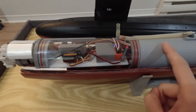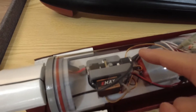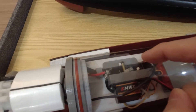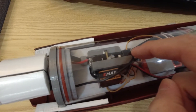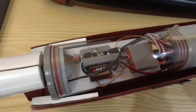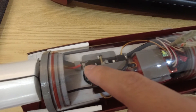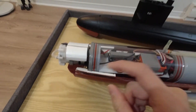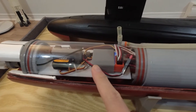Between the water pump and the ballast tank we have a servo-operated pinch valve — a very simple system. A micro servo operates a small brass roller attached to the servo arm. As the servo rotates clockwise and counterclockwise, the roller releases the black rubber hose, allowing water to flow freely in and out of the ballast tank. At the same time, the servo arm hits one of two micro switches that run the pump either forward or reverse to fill or empty the ballast tank.